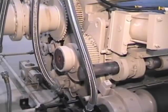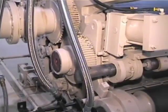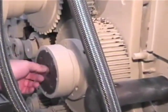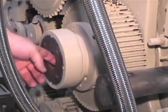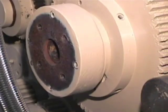We are going to take measurements for sizing and bending our siphon pipe. First, inspect the end of the roll. Make sure that there are no steam cuts. Also make sure that the old gasket has been completely removed. Inspect the gasket for scratches and steam leak paths.